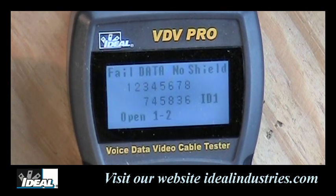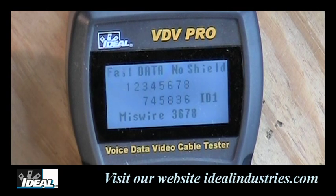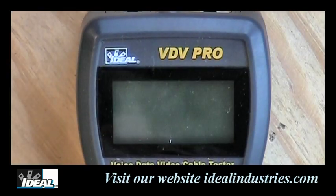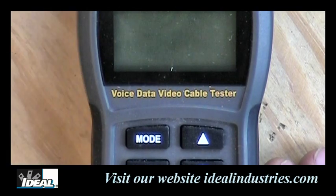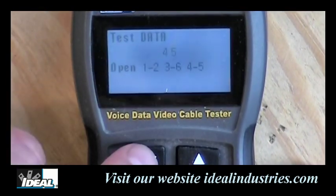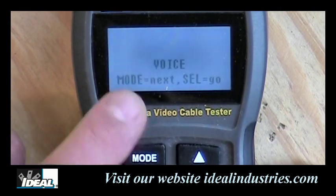And you'll see the tester is actually pretty simple to read and figure out what it's trying to tell you. And we'll move on to phone testing next. If we're going to use the VDV Pro to test for phone circuits, one of the first things I'm going to do is turn the tester on, and any button again turns it on. And you'll notice it's trying to do data testing, so we're going to hit the mode button here until we hear or see voice there for phone testing.